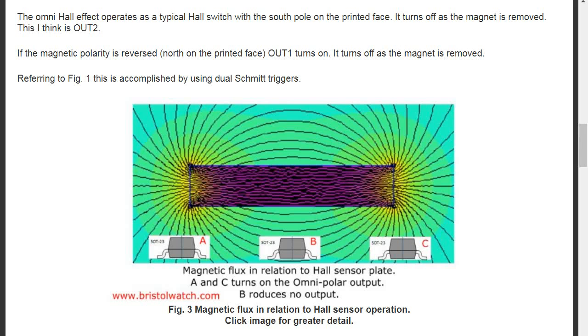Let's look at this diagram and note a few issues. This is typically a bar magnet. Here I have spaced hall sensors, and the plates are parallel to the printed face — on the upside of a circuit board. Before this hall sensor will switch, the magnetic flux needs to be perpendicular to the hall plate — that is, vertical. At positions A and C, the magnetic flux is vertical to the hall sensor, or perpendicular to the hall plate.